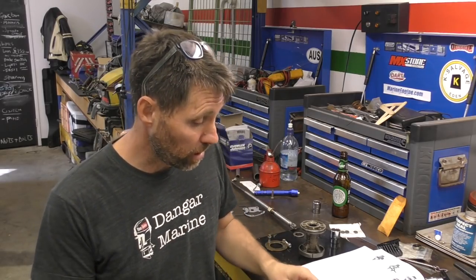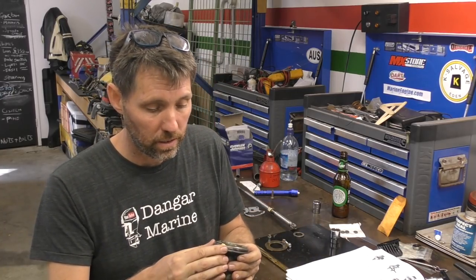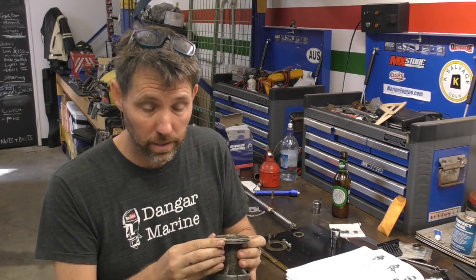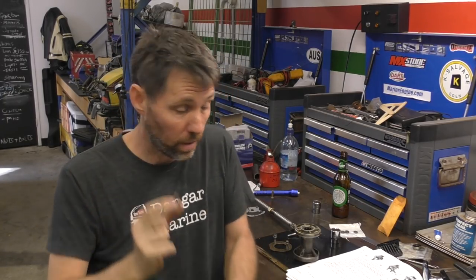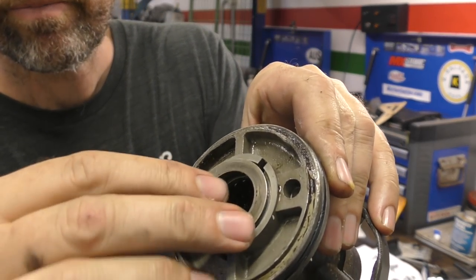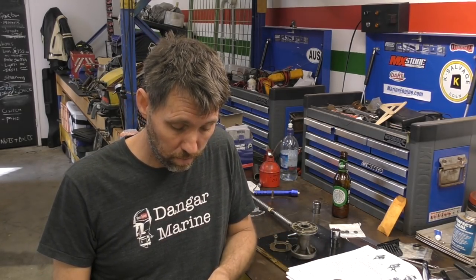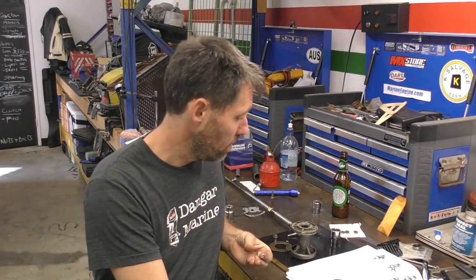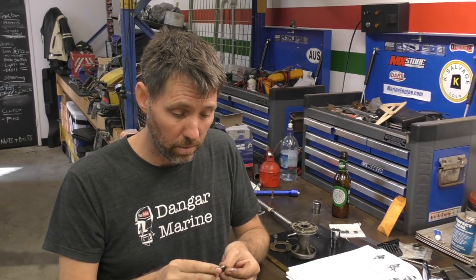I can't see a part of the manual that actually specifies, but I'm just going to put a little bit of marine grease around this inner flange and on the o-ring itself. Now I'm going to install the reverse gear thrust washer, which sits in the forward side of the bearing carrier. The service manual says to install it with the needle bearing assembly grease, which I presume is really just about holding it in place until it's all put together. This particular washer doesn't seem chamfered in any way so I don't think it matters which way around it goes.